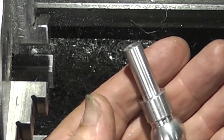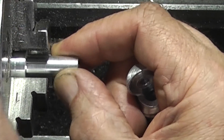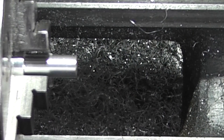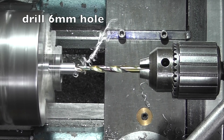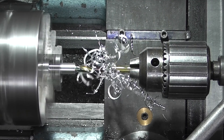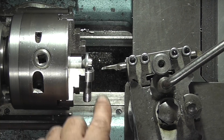Okay, that's the part that we've just made. If I hold it in the end of the chuck I should be able to get the thread on there and drill a hole through. This is the half sphere again and what I'm doing now is putting the groove back in and turning the diameter.